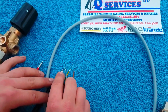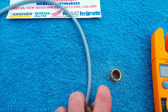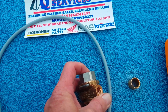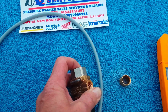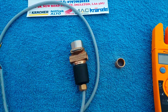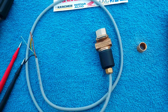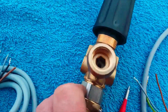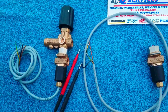You need a signal to make the machine start when there's no pressure on the system. If we push this unloader - pretend it's pressuring against the unloader and it's pressurized up - with no signal, the machine automatically stops. If you've got a leak on the system sometimes what we've also got is a non-return valve in that unloader as well. So if the machine could be a pressure problem within the system itself from the trigger to the unloader, it's making the machine surge - jip jip, starting stopping, stopping and starting. And that is the pressure switch that's controlling that. And inside the ST261 you've got a non-return valve in there and it can be that that's causing the problem as well, to make that machine surge continuously.